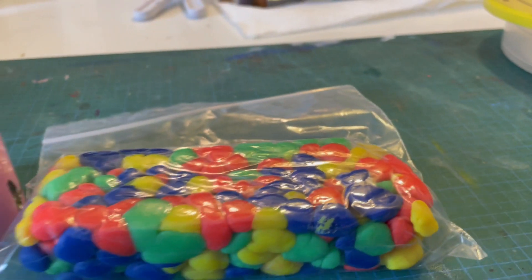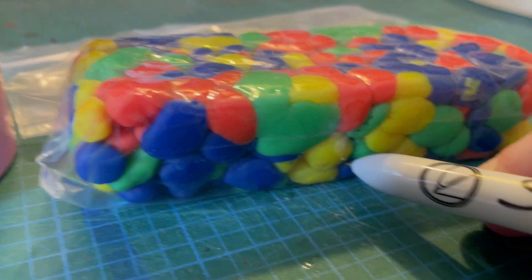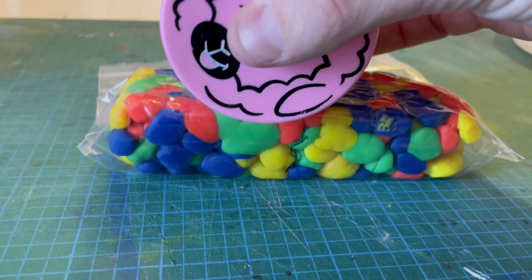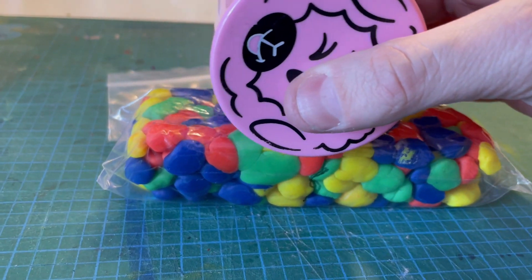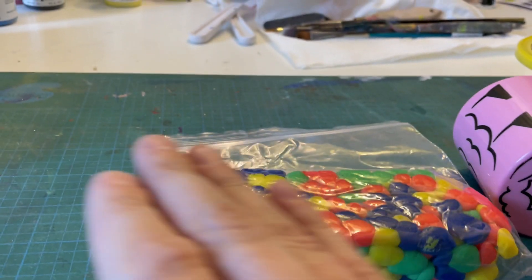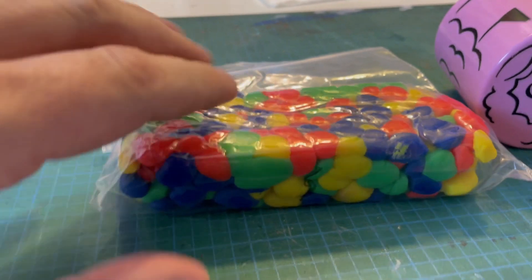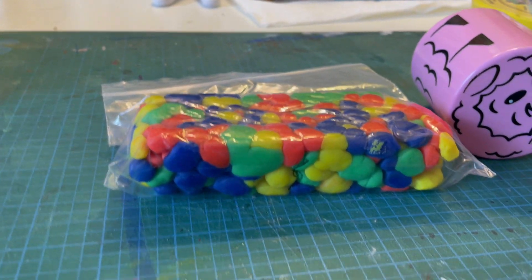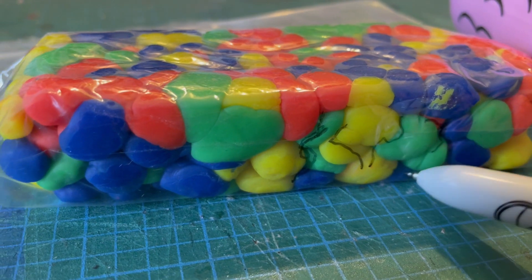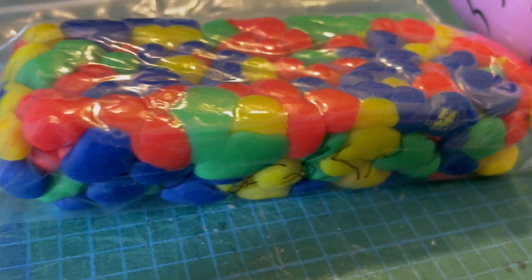Let's say we have a crack that forms down inside here — I'll draw it in black. As this roller goes across, it's going to flex and depress more in that spot. For that little fraction of time, the strength and the crystal structure has been compromised, so there's a little bit more flex where that crack is starting to happen. It's not going to be just one crack — all the cracks between these crystals are going to start to break down depending on where the bearing is in its cycle.